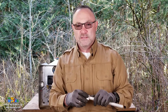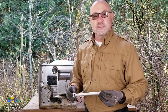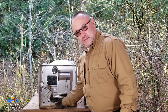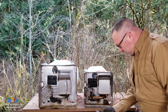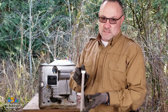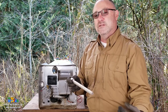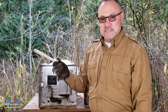And the reason we get called in to do that is because a water heater's got issues. One of the things you're supposed to do every year is inspect your anode rod. The anode rod is in the bottom down here, accessible from the front. The anode rod doubles as a drain plug. So every year you're going to pull the anode rod out and inspect it. If it's 75% or more depleted, you're going to replace it. They're under $20. They have magnesium and zinc.